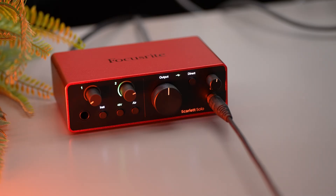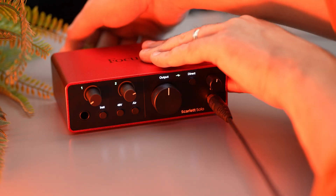If you don't know whether your microphone is dynamic or condenser, check the manufacturer's website before connecting it. If you have a dynamic microphone, it's important not to turn on the 48 volts phantom power because your microphone doesn't require any voltage. If your microphone is a condenser, connect the microphone first and after it's connected, turn on the phantom power. It is not recommended to connect the mic while the 48 volts phantom power is on. If you want to unplug the mic, first turn off phantom power, wait a little for discharge, then disconnect.